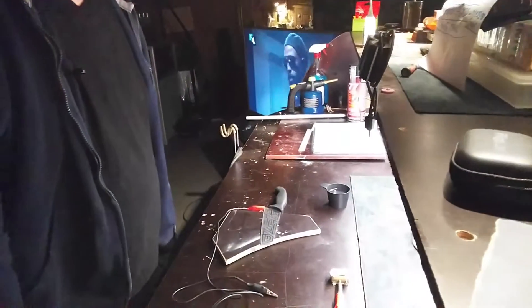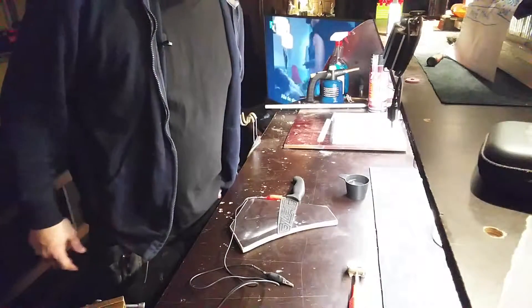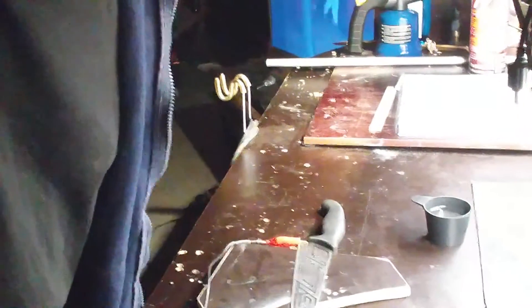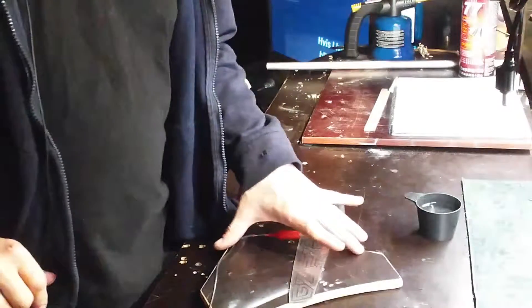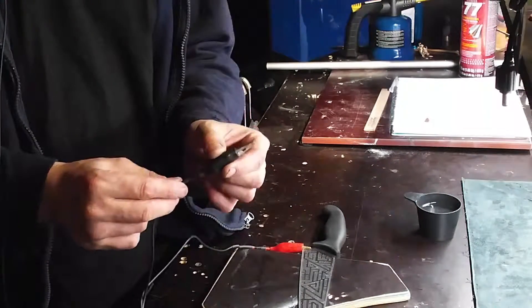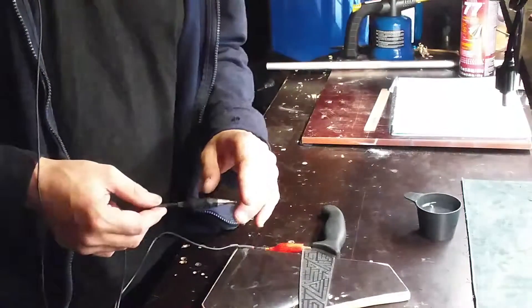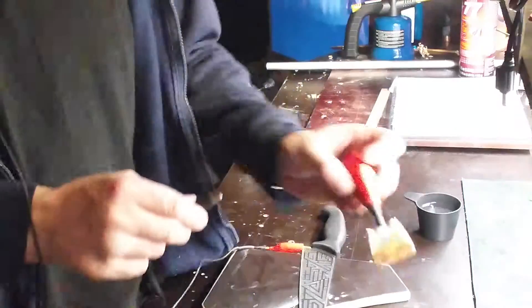Here at the table — I'm going to zoom in to the knife. What you see here, I've got the plus side attached to the blade, and here's the negative. 12 volts, sometimes 15 depending on how my machine is doing that day, and of course the negative — the ground. You want to put this on the stamp. When you do this, you just dip it, make it a little wet, just a little light, because these guys don't really soak up as much as you would think. You've got to go slow.